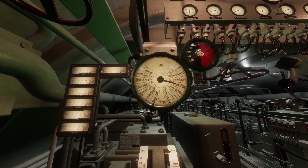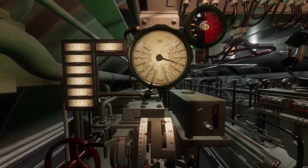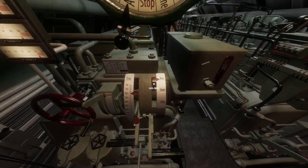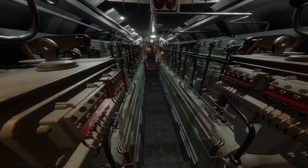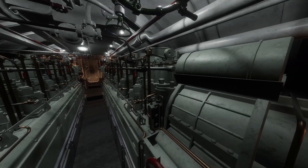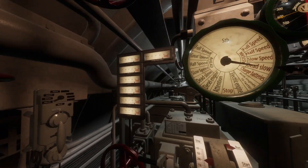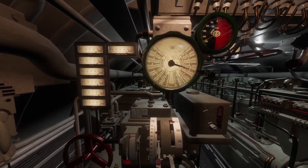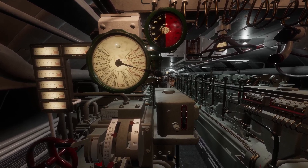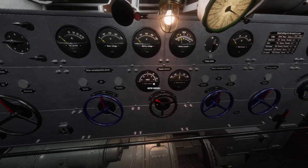So the way we do this — on the starboard side here we'd bring the engines back, turn off the supercharger, and bring the engines down to about 200 RPM. We let the RPM come down, and then we need to go closer to dead slow. What we're going to do now is disengage this and immediately the engine will spool back to life again and should sit at around 500 RPM. This keeps the diesel engine warm so the second you get orders on diesel again it's ready to go, but it's no longer providing any power to the propeller — the propeller is just not spinning on the starboard side.